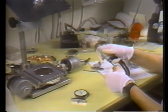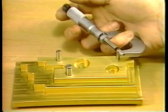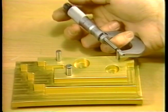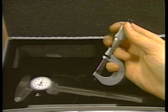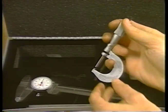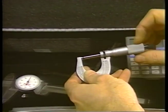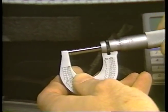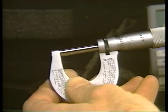In today's lesson, we'll focus on the micrometer, sometimes referred to as a mic. Micrometers are often used when specifications require more precise measurements than can be made with a steel rule. The mic is also a much more complex instrument than a rule. It is a mechanical device with adjustable operating parts and several sets of scales which use either the decimal inch or the metric system. You should know the names and uses of each of these after this lesson.